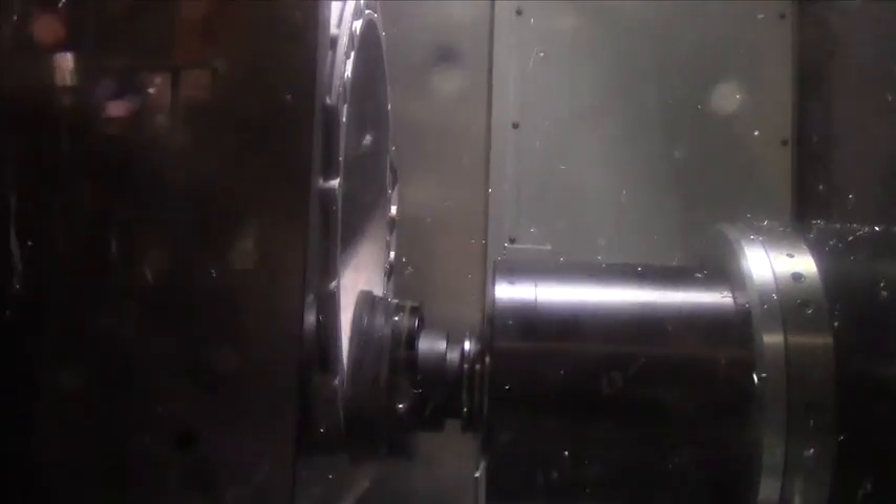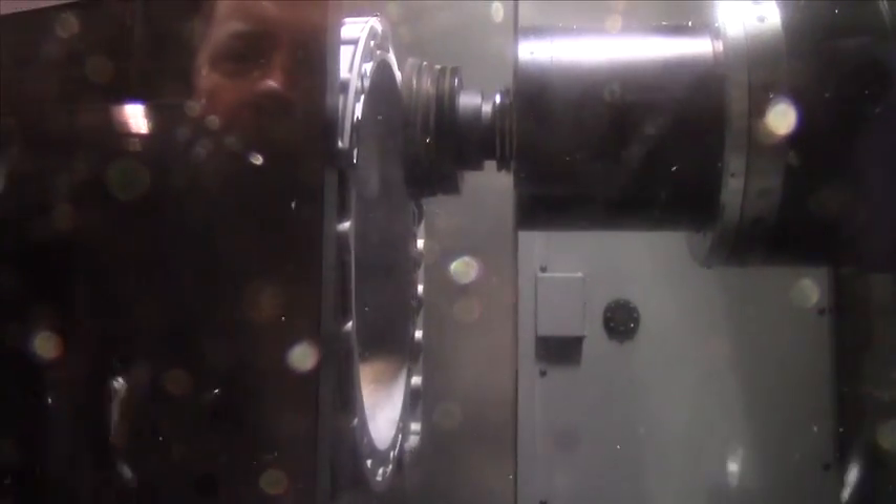And the tool changer — how many different tools can it turn? This is a 60-tool ring on this machine standard, and we also have optional matrix magazines for operators that need more tool content for systems and other applications. We were just watching an aluminum transition housing being machined — milling, a little bit of drilling.